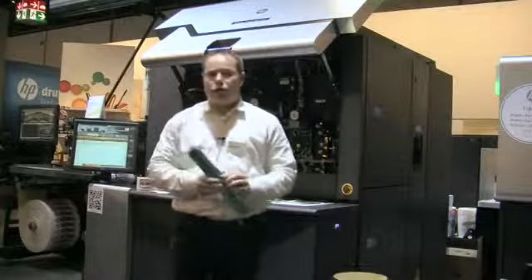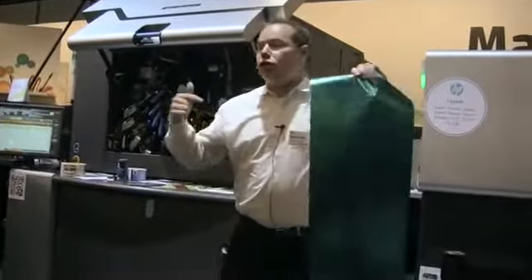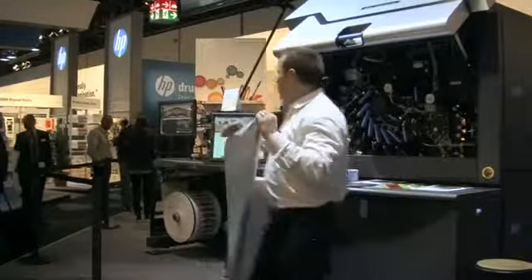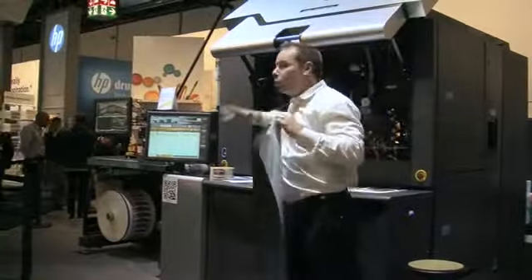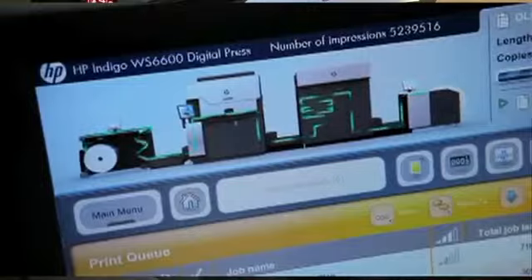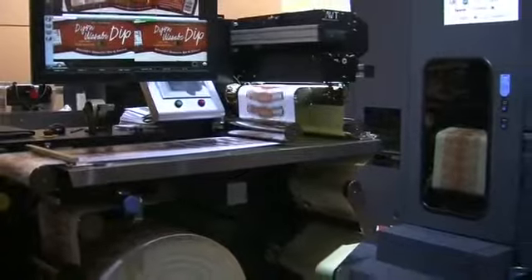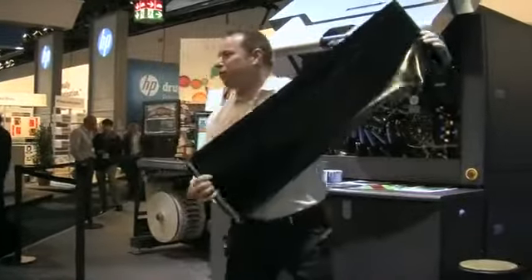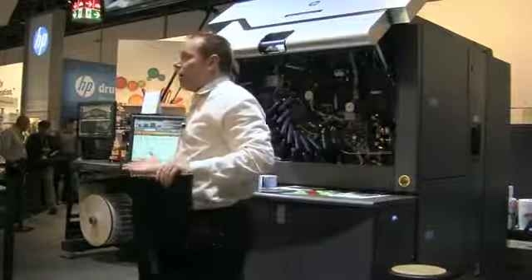This is the plate we're using — it's a photo conductive plate. This plate is charged and then discharged every single revolution. I'm doing yellow, magenta, cyan, black, orange, violet, white — whatever. I'm printing seven colors on this press. Job after job after job, I use the same plate as well as the blanket. The blanket is also electronically charged, and it's very similar to offset if you were to feel it. This allows us to go from one job to the next with really no make ready.